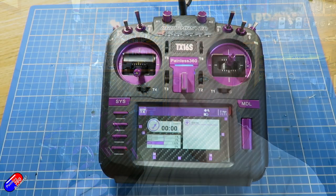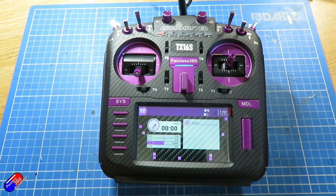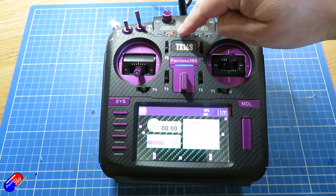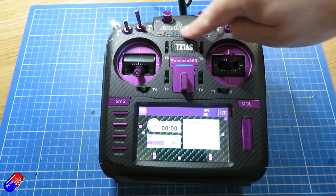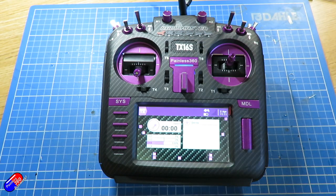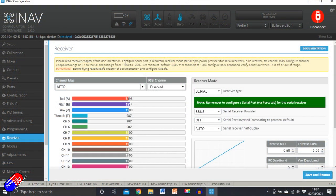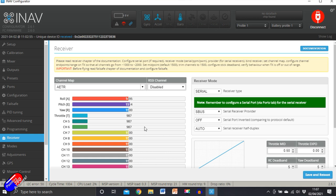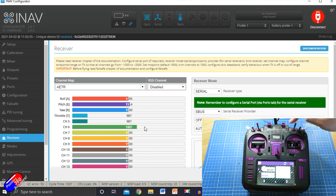Let's answer Missile TM's question. Here we are on the bench — let's quickly show you how to set this up. This is a RadioMaster and we have channel six on this particular model memory set up to be these six controls along the top. On the computer in iNav, I'm connected to the flight controller with iNav running on it and the receiver plugged in. If we look at channel six, which the buttons are connected to, as I press the buttons you can see the values changing from a maximum of about 2010 down to a minimum of about 987.